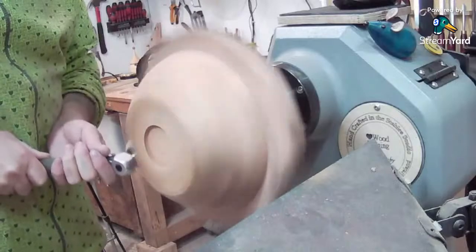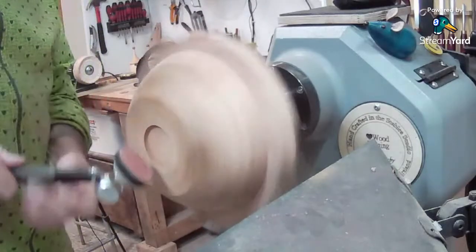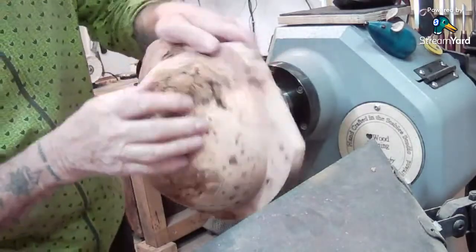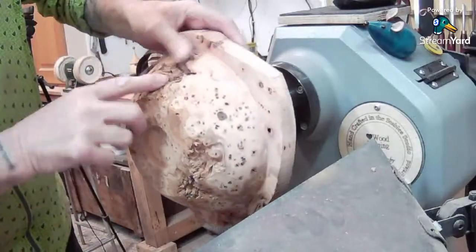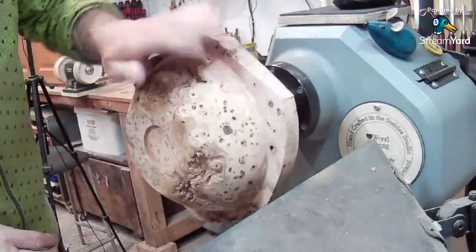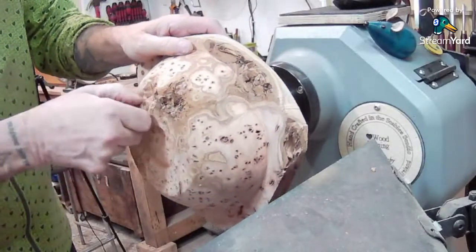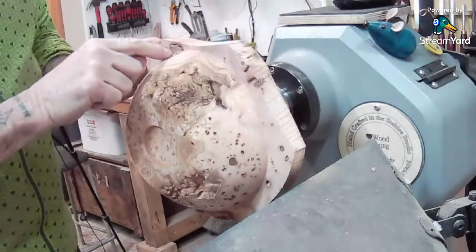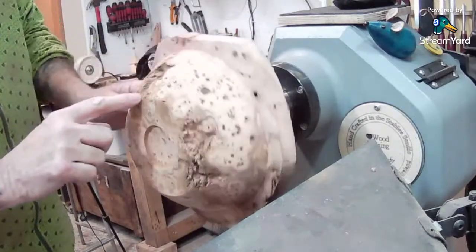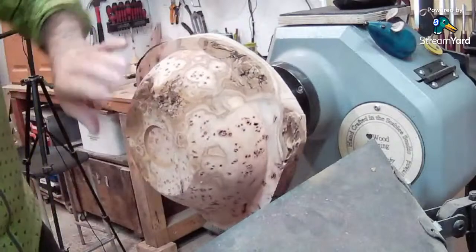That's actually quite a hard place to sand in, eh? But loosen that. Have you got one of those dentist picks? I have, but I'm going to leave it alone, Mark, I think. After you sand and seal, you might get a little bit of super glue in there. I don't think they're all that wobbly, to be honest. It's just this bit here is probably still bark. But I quite like it. After you sand and seal, just drop a little super glue down into the cracks. I will. That'll just stop it coming out when it goes in the house.